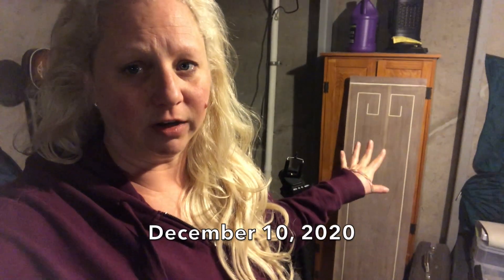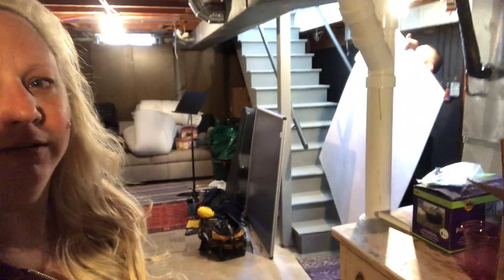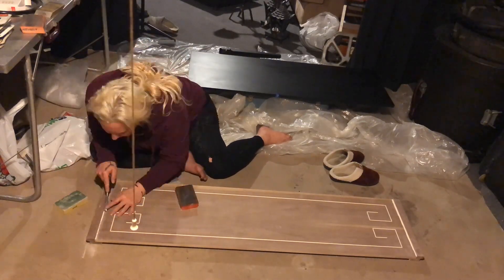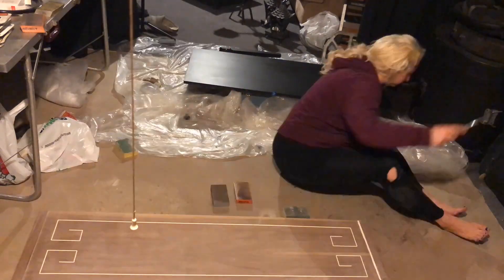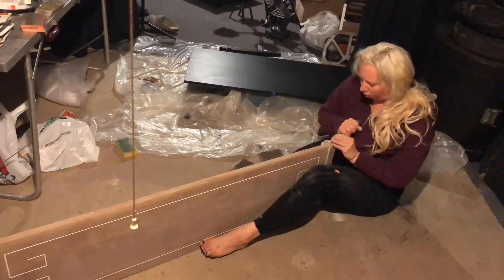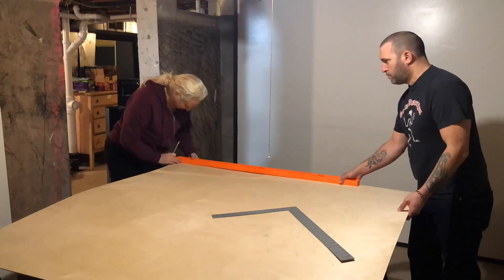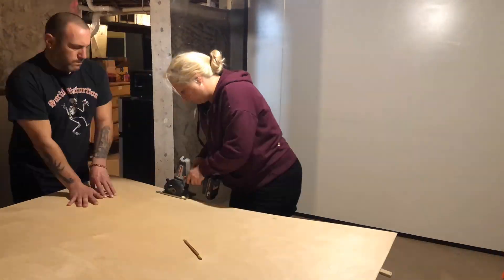After seeing the final results of the foot panel, I decided not to use wood filler on the face panel. Because there are edges on each side, the best option seemed to be fitting a piece of plywood on the face to cover them completely. Thank you to plywood specialty and supply up in Green Bay — we picked out a piece of eighth inch birch plywood. I need to hand sand out the remaining lacquer on both sides. Using both a chisel and sanding pads, I finished cleaning off the face and did a rough sand of the back of the panel. It is painted white but not with lacquer, so I don't have to clean it off completely. A table saw would have been the best way to cut the plywood, but we don't have one, so we're going to do the best we can with a small circular saw.